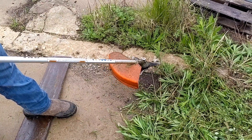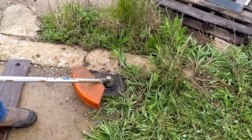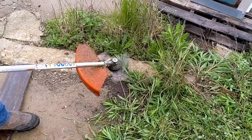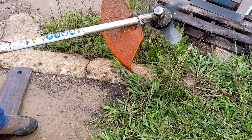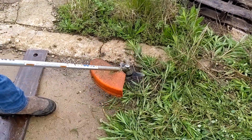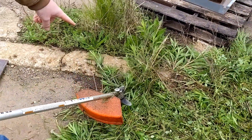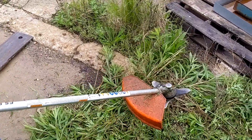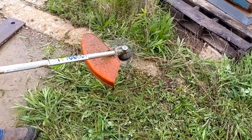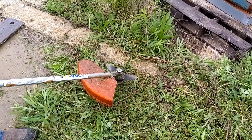This is the beauty of this steel blade — you want to go very gently into it. Obviously you don't want to do that day in and day out, but for demonstrational purposes, that is exactly why I put this steel blade on this weed whacker, so that I can rub stuff like that. But if I would have just jabbed it into there, it would have knocked it off-center of the arbor. So now I will mow right next to the concrete, and you'll see how well this works. I was rubbing the concrete a little too intensely there — you're not supposed to do that — but you can see that it does take it, and it eats it for lunch.